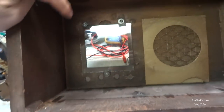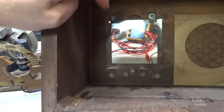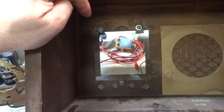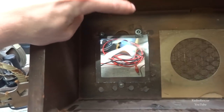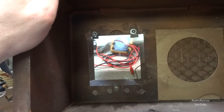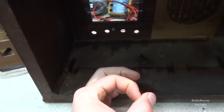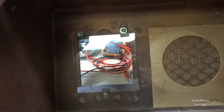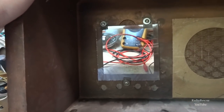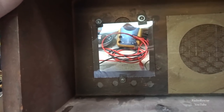So we just found some really short screws, and of course I cut my piece of glass out 5 by 5 inches, and then found some of these little spring clip deals here that hold the speakers in on some of the newer 60s radios. They kind of just slide over the plastic down over the speaker. Now, if you put a screw and a washer through those things, they hold in the glass pretty well. So I believe that'll suffice as a little bit better dial glass.